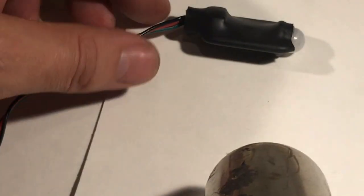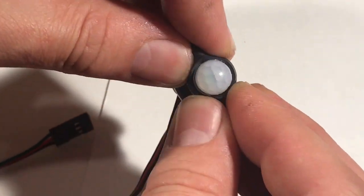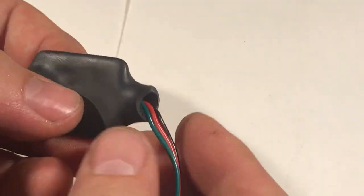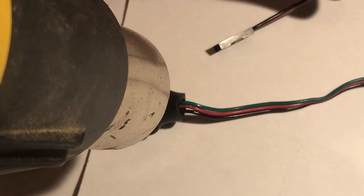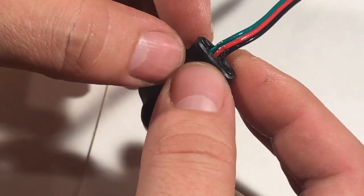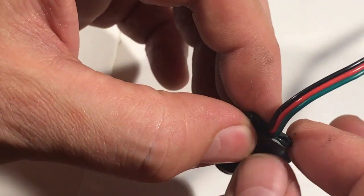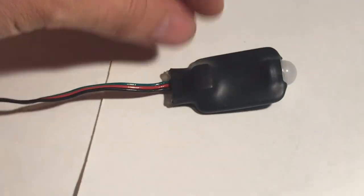I'm pinching it up and squeezing it together to dry the glue. I'm going to heat that piece up again and push it up around as well. Look at that — that's awesome. We let the back dry and we're going to heat that back up and do the same with the rear. Be careful, that's hot — have a little cloth nearby. As you can see, we've got a nice waterproof seal. That's a nice ruggedized motion detector.